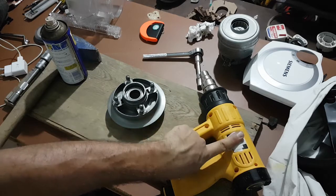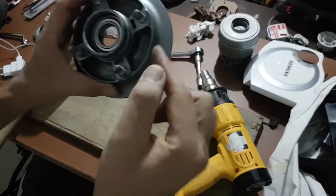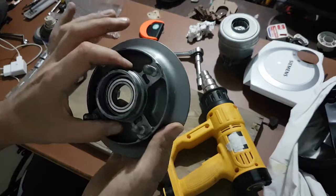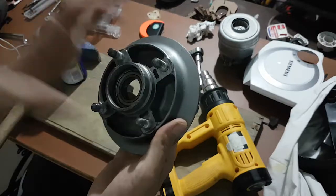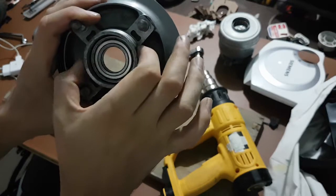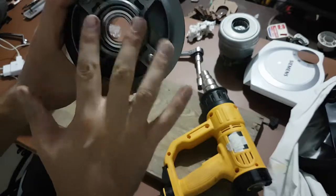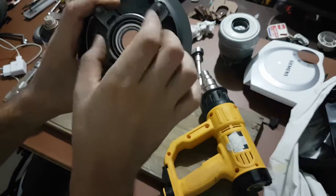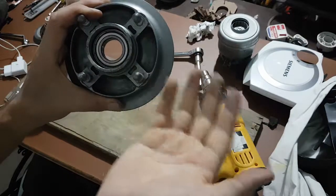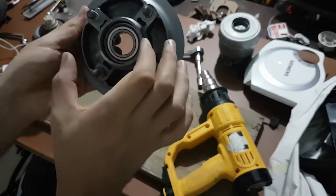The key point is the use of heat, and it was what I was doing wrong. The thing is, you need to apply high heat for a short duration. The reason: you just want to expand the aluminum — the metal around the bearing. In this case, that is aluminum, but it may not be aluminum in your situation.